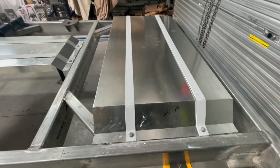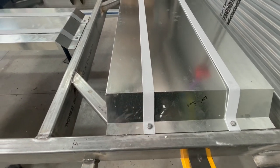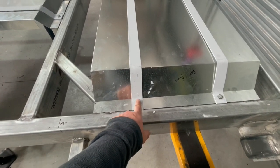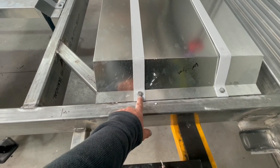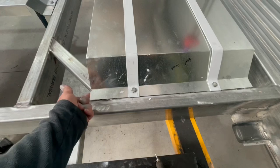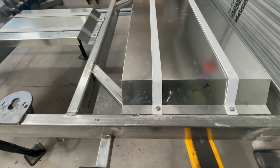That's the tank shrouds on, all complete. So I got 40mm, 3mm thick gal straps down to the brackets I put in that I showed you in a previous video underneath here. They're bolted down. There'll be split washers here to stop those rattling loose. And I'll be able to also add washers underneath the shroud to get a bit of height up and down. Or maybe a bit of nylon or something in there, I'm not sure yet.